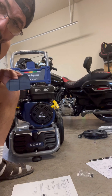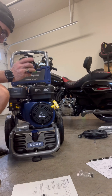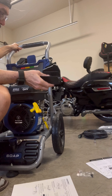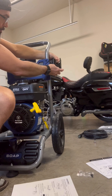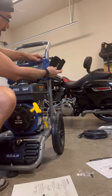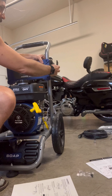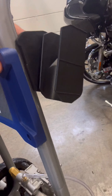I realize I was trying to do it the wrong way — I was trying to get it pushed between the blue casing and the bar, but it doesn't go there. It goes on the back side of the bar. You just put it against the back side like that, and these two pieces will squeeze together, then you run the screws through it. That's the way you do it.